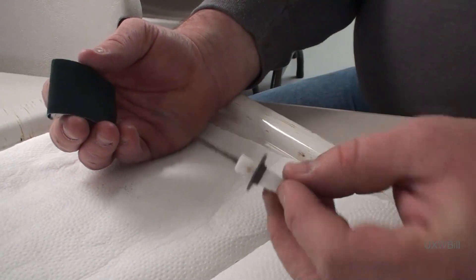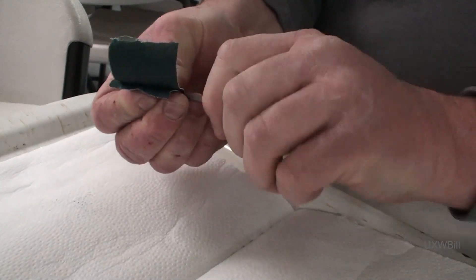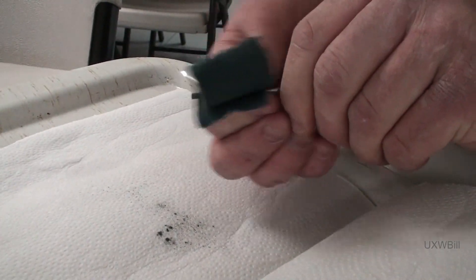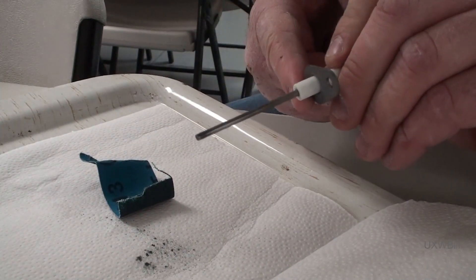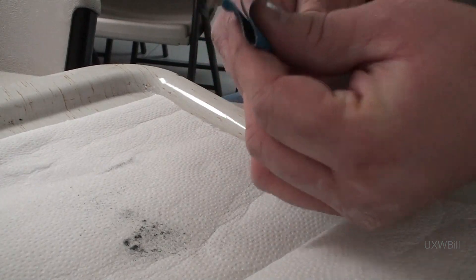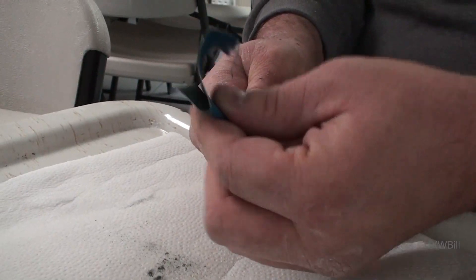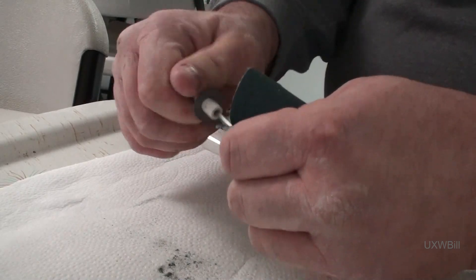Okay, so here we are. Here's our lovely little dirty flame rod, and here's some emery cloth that I've got. I know you see some people on YouTube doing this with money, but my budget certainly doesn't run to that — and this is really the way that you should be doing it. Look at that gunk coming off! Yeah, that would probably be quite a bit of it. Some of that, of course, is the material coming off the paper itself. But that rod is starting to look nice and clean now — it's actually shiny again if the light will catch it just right. So here in a moment we'll put it back in the furnace, and I'm not too proud to admit that I dropped the screw that holds it in. It's behind the draft inducer somewhere. The key keeper's gone to get a search magnet because I didn't think to bring one with me — I'm not even sure I own one, to be honest. I didn't even bring a magnetic screwdriver with me. So we've got to rectify that little problem before we can put the flame rod back in, and I really do not want to have to take the draft inducer assembly out of that furnace.